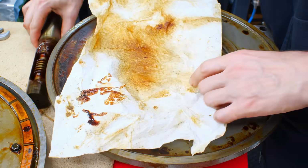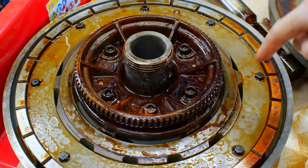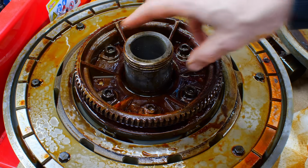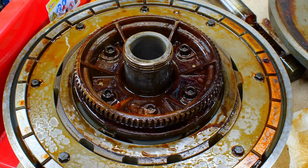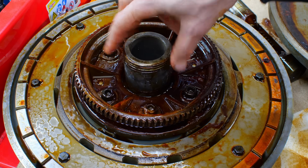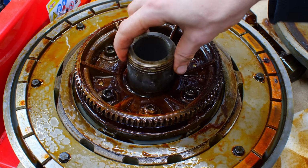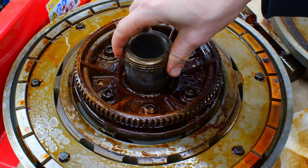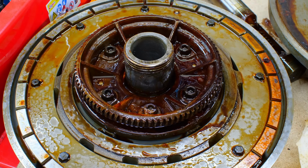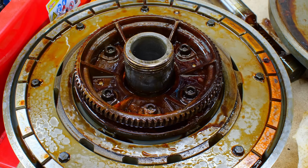Interestingly enough, a little interesting design feature. When I pulled the table off, I noticed that this part here is loose and wiggling around all over the place, and I was already worried that the casting might be broken. But thinking about it, this hub here in the center is not the guiding element. This is free floating on purpose. This has side-to-side float, and this is not guiding the rotary motion of the platter.